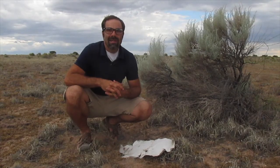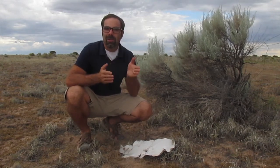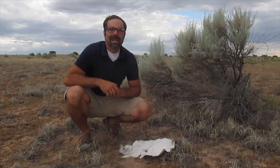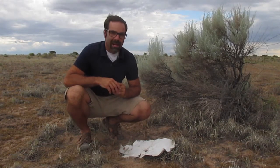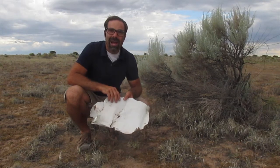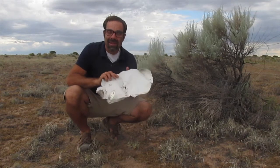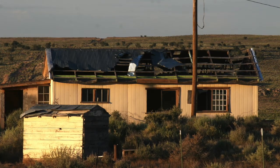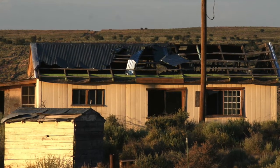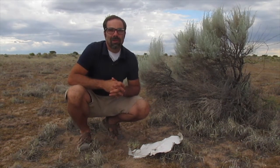In the last episode I talked about how I redesigned the roof from more of a traditional peak slope roof to Pueblo style, where the roof is actually tucked inside the walls. The reason I did that was because of the high winds here. It's not uncommon for me to go for a hike and find pieces of roofing that have been ripped off buildings and blown for miles. Here's an example of a building nearby where the roof has been completely destroyed by the wind. So in order to keep that from being a problem, I made the decision to switch to a Pueblo style roof.